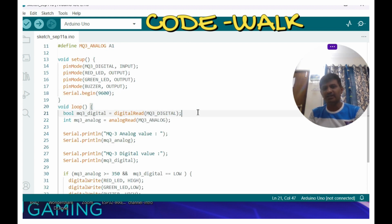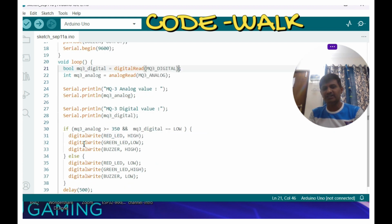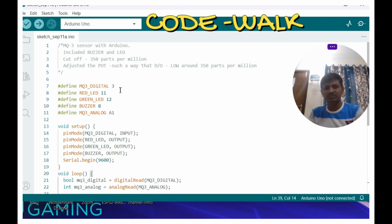In the loop, we are reading the digital and analog values and printing over the serial. If the analog value is more than 350 and digital is equal to low, then we are indicating the red LED is high, green is low, buzzer is on, friends. Otherwise, red LED will be low, green LED will be high, buzzer will be low, and this loop function will be executed again and again every 500 milliseconds, friends. So the link of this code we are providing in the description. So this is the one.